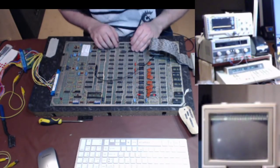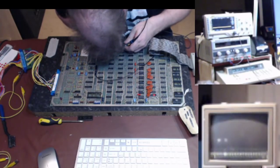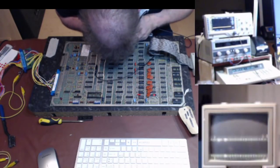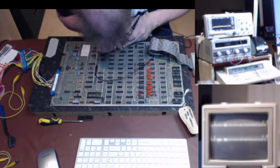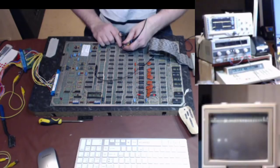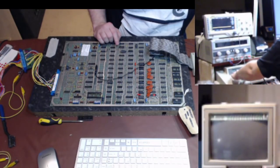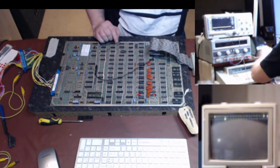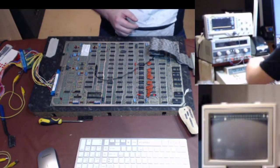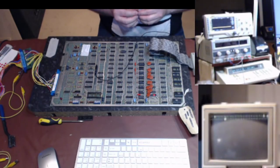There we go. And now it's grounded correctly, which means that 3 in and 4 out is... Looks like... B6, 3 in, yeah, 4 out, inverted correctly. And now I've got no bus short. So if I take off C5, yeah, so I found the bus short. One of these 2 chips is bad. Yeah, so it's definitely one or both of these is bad.